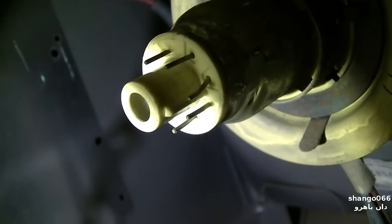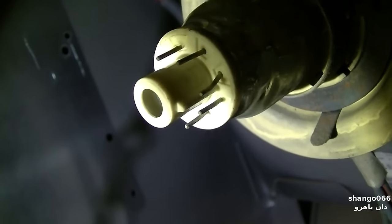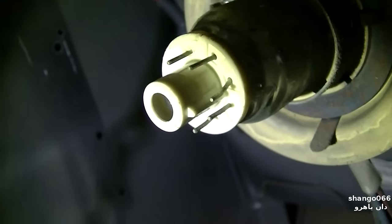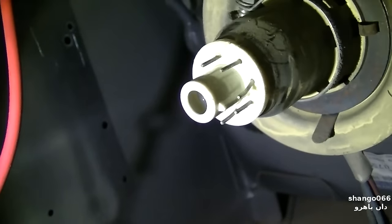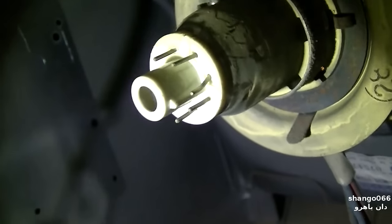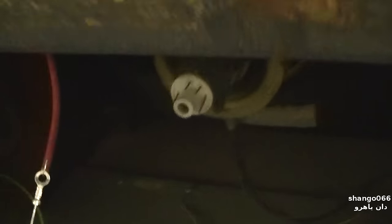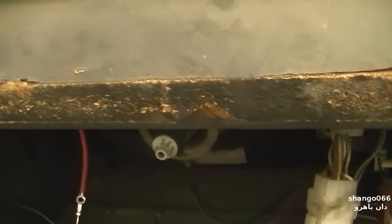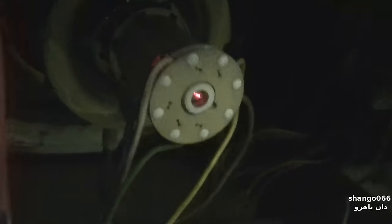Hey, can you see what's wrong there? Somebody bent the pin so that the pin is going into the key slot, not the actual pin hole on the CRT socket. I couldn't see it - it's so dark in here. That's what I was basically missing. Anyway, yes, someone else worked on this before me. So there you go. And now we have CRT illumination.